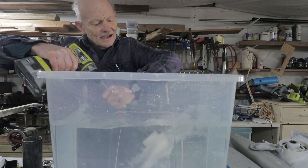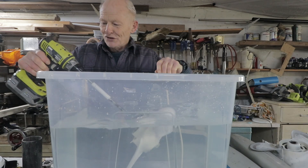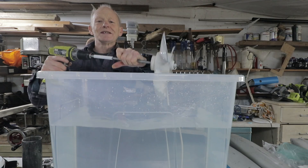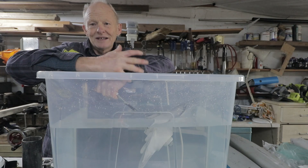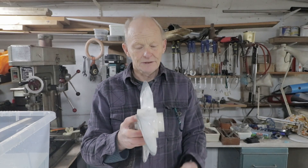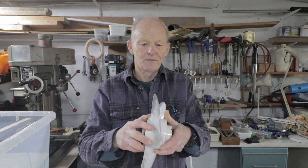Switching to the one we're currently using — actually it feels nearly as good as the one we've got at the moment. Testing the final propeller — to be honest it's pretty close. Obviously this isn't the world's most scientific experiment. We just want to make the propellers on our boat work as best they can. The baseline Yamaha standard propeller gave reasonable astern thrust. Our current propeller I could hold quite easily going astern — it's not giving much drive. Interestingly the new one seems almost better, suggesting that by refining this edge you can gain a bit more efficiency going astern.